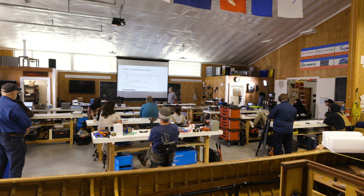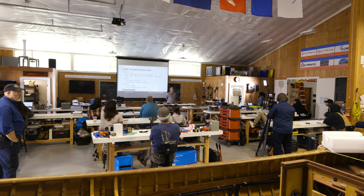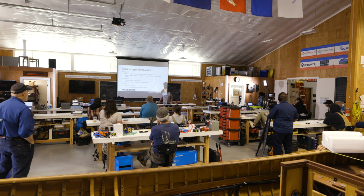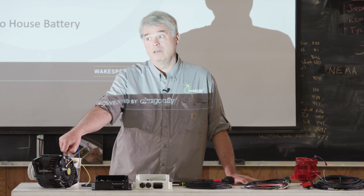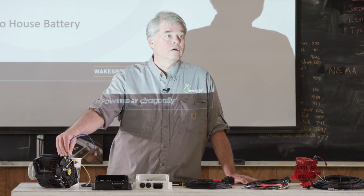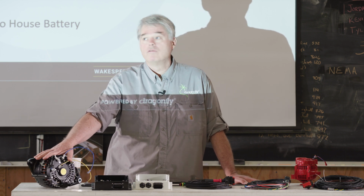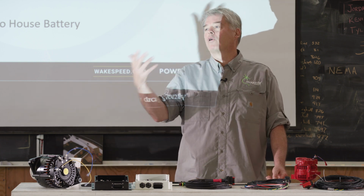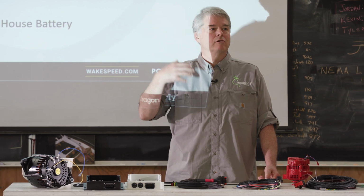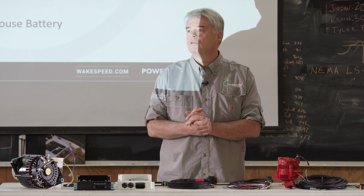Thank you. All right. As we start eating up the food chain to get more generating capacity, one thing I haven't talked about is I said that I consider high energy systems anything with a 3 or 4 kilowatt head or better. In the 12 volt world, a 250 amp alternator is a pretty big alternator. And realistically delivering 200 to 225 amps, that's a lot. That's at 3 kilowatts. And that's kind of the realistic upper side for the 12 volt world. I usually say 2 kilowatts is the 12 volt world. At 4 kilowatts, you double the voltage at the same amperage, you're going to get twice the power out of it. So 4 kilowatts is kind of a realistic upper limit for 24 volts.